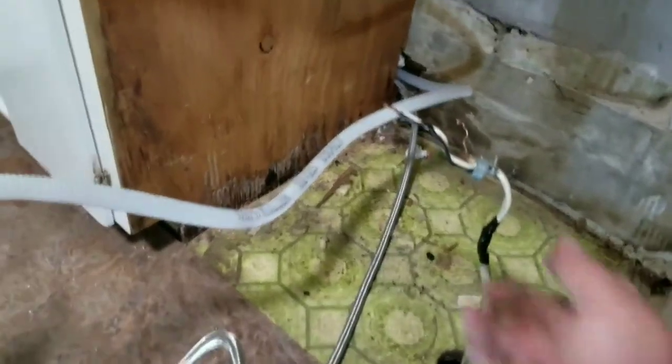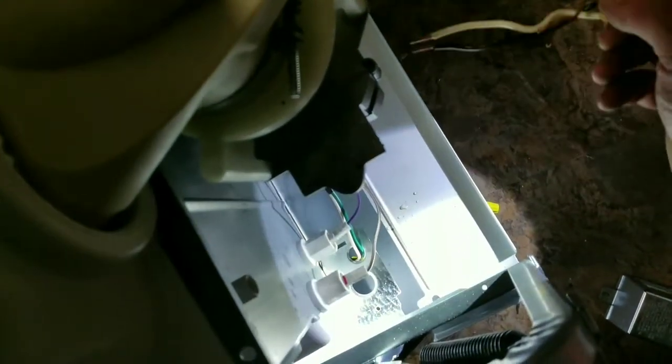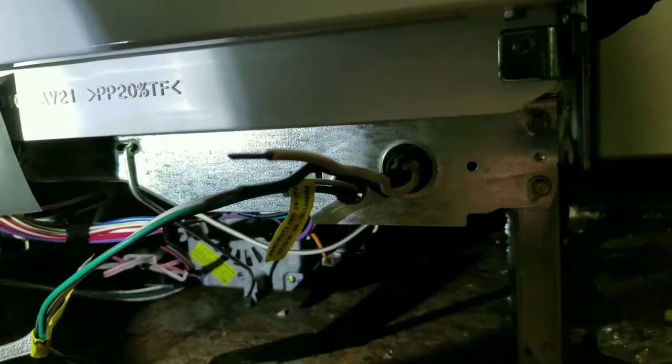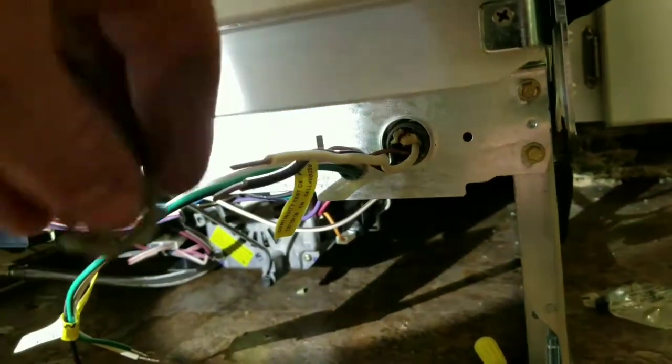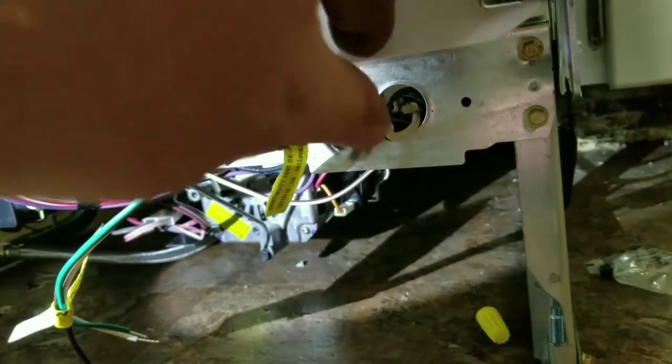And for your electrical, I'm just going to feed this down through the hole there. I'm going to have to take the front off to be able to wire this thing. So let's go ahead and lift it up and take the front lower panel off and wire it. Basically the same process as the old one — just a screw here, a screw up top, which you don't have to take completely out, just take it loose and the panel will slide over. Same with the top on the other side and on the bottom. Once you get the front off and you can see your wires, don't forget to put your nut back on — slip it over your wires and thread it back on.